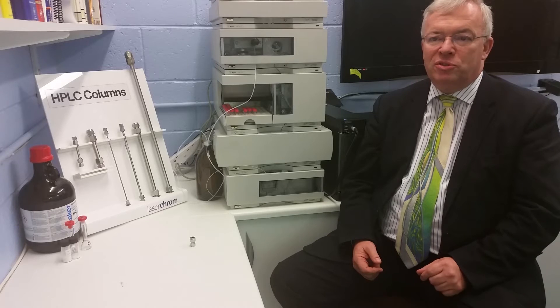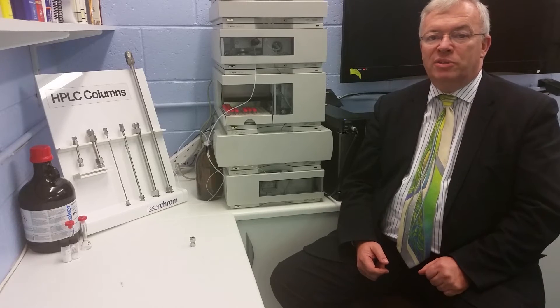The actual pressure can give us an indication that something has gone wrong. If normally it's 200 bars and the next day we come in and it's 300 bars, this is telling us something and we need to act accordingly. If the pressure is normally 200 bars and it's now 300 bars, it may be the column heater's not on so the viscosity is higher, we may have the wrong column with too small a particle size or too long a column, there may be a blockage, or we've made up completely the wrong mobile phase, maybe just water without acetonitrile.